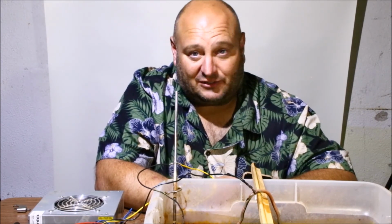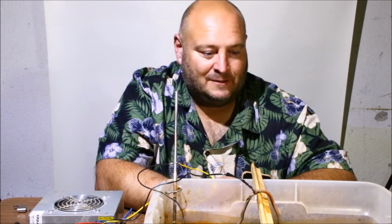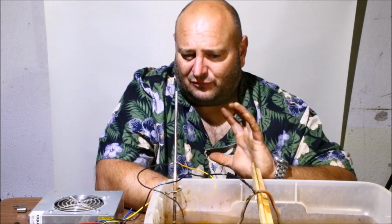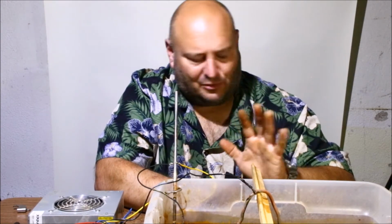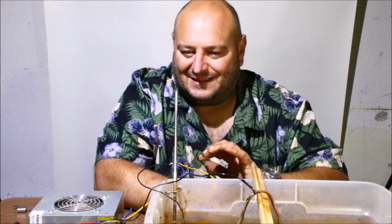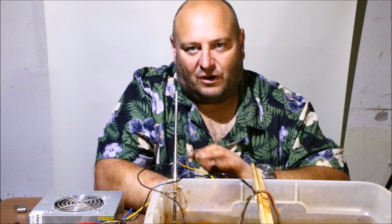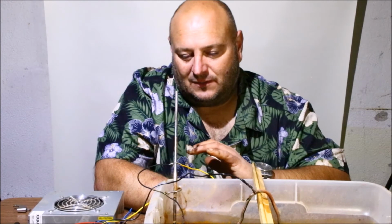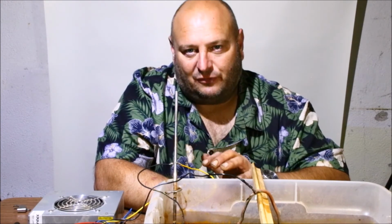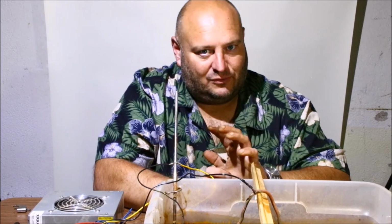A lot of museums actually use electrolysis for removing rust off items. It is one of the better ways of doing it, for the cannonballs, big items like that. Another thing too, not necessarily for the copper and stuff like that, it's not going to happen, but when you're dealing with your iron items, it needs to be addressed as soon as it's done in here. Rinse it off, and you either have to wax it, or whatever process you're doing with it. That's a whole other topic on what you use on that.